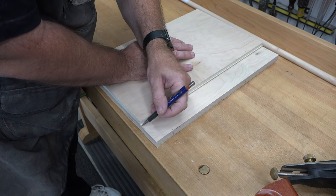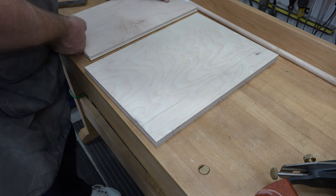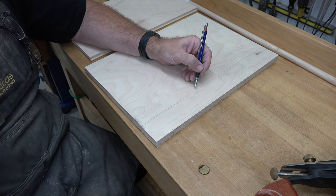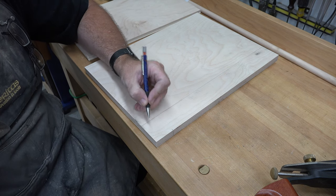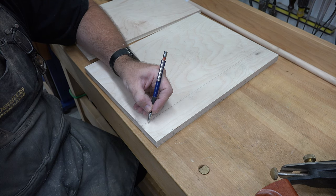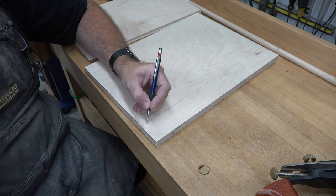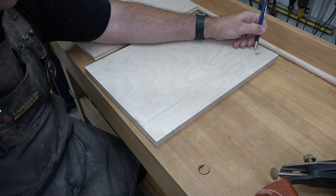Just like that. We're just going to mark that off so we know exactly where it is. And the next step is I want to take this over to the table saw, and I'm going to cut about a 3/16 inch wide by 3/16 inch deep dado all the way along there on the outside of this